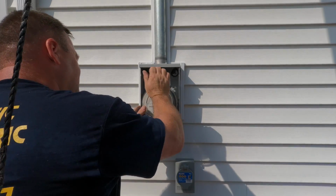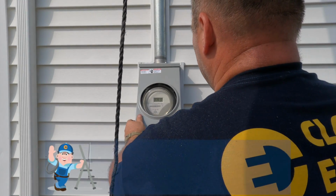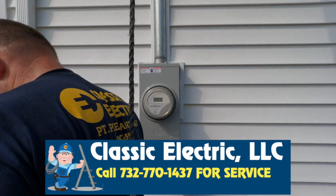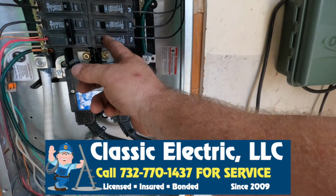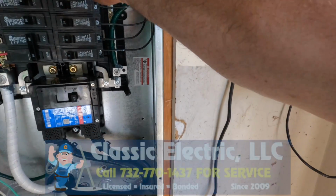You wouldn't believe the trouble I had with this meter enclosure. The prongs that accept the meter itself just weren't centered. So here it was energized and I had to manipulate them so I could get that meter in, but all's well. All's good and ended well. So I turned the main breaker on and there was power, and then each individual circuit breaker after that.